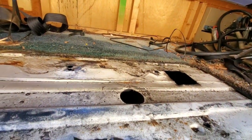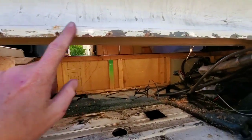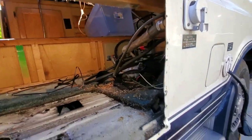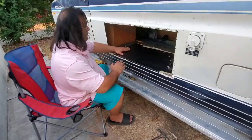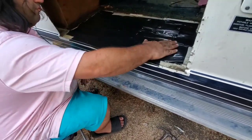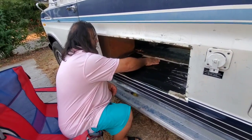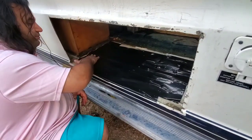In the home stretch, but we've got to get these holes properly sealed up and watertight, and then we'll be able to fit the frame back in here. Marshall's gone ahead and cleaned that up real well so we can use the butyl tape, which is the new industry standard for sealing exterior fittings, exterior windows, and things on motor coaches as well as marine applications. I like to use construction flashing because it's the real deal. The last thing to do — the surface is all prepped. I'll let Marshall put the butyl tape on once it cools a bit; you can't work it when it's hot, it gets too gummy.